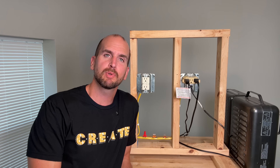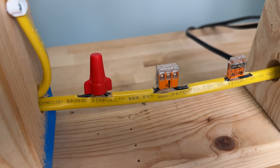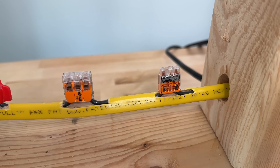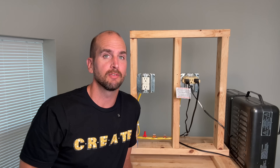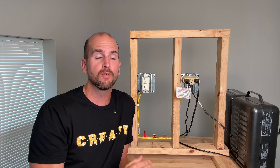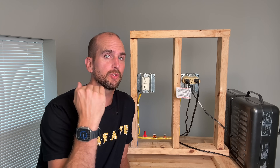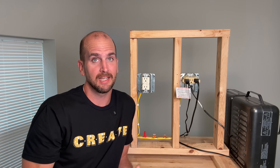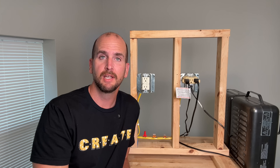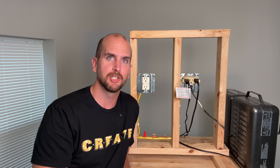How's it going, you guys? It's Scott with Everyday Home Repairs. Today we're continuing on with some load testing for different wire connectors. We're gonna test the standard wire nut versus my favorite, the WAGO 221 lever nut, versus the WAGO push-in connector. Push-in connectors are very convenient, but the question is will they hold up? We're gonna test them today over their design loads — designed for 12 gauge wire, 20 amps — going all the way up to 30 amps for 25 minutes to see how they hold up.